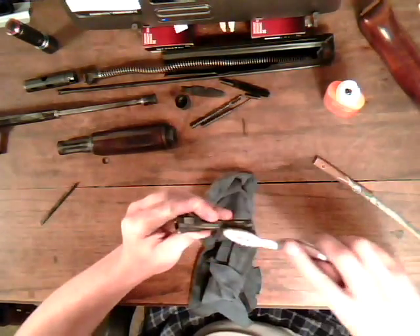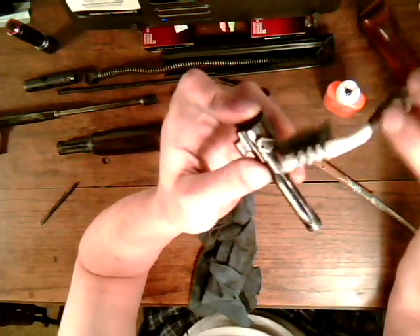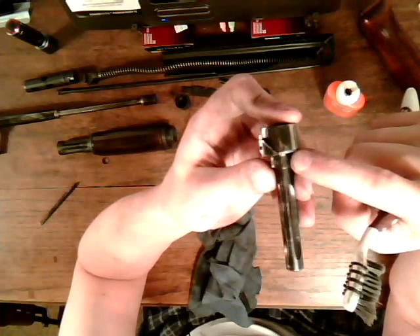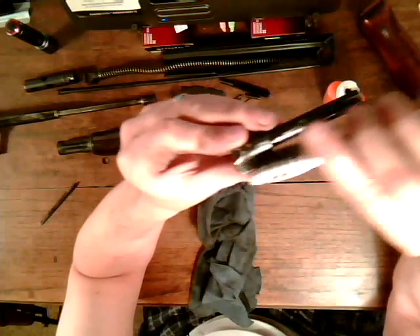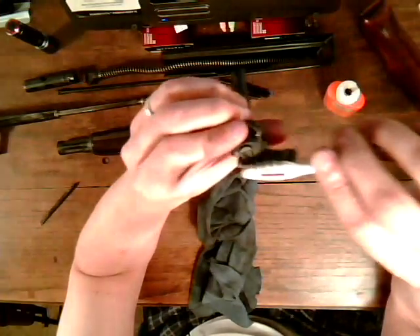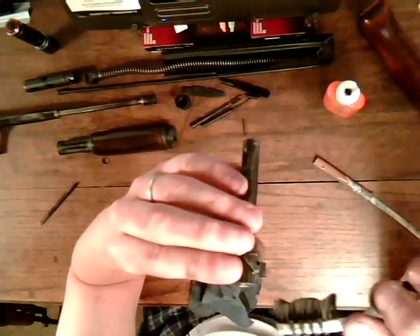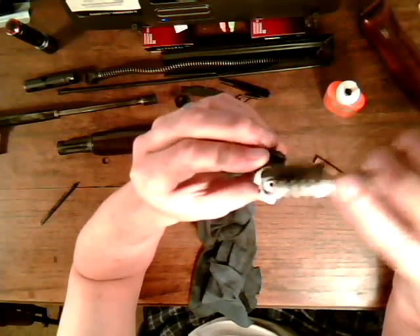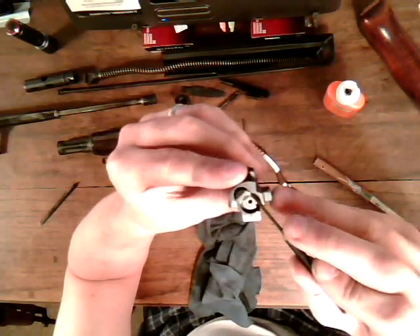Then you're going to take your toothbrush. Once this is all dry, you're going to get into all these little cracks — everywhere that there's a lip, all these grooves, you want to toothbrush those out. Anywhere up here, every little lip, you're going to want to toothbrush it. You're going to want to toothbrush out where the actual casing sits. Make sure there's no little flakes of metal in there. You always want to get right underneath the extractor here — there's always crap under there. Your punch should fit in there; scrape that out.